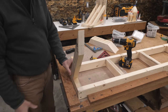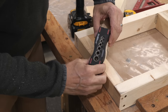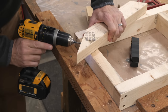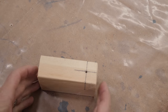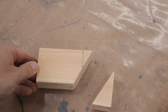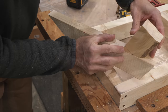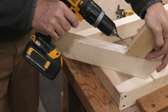The 30-degree end attaches to the underside of a shelf cross member; the other end screws to a stud. For the 60-degree end I used a drill block, marking a cross on the angled cut then drilling a perpendicular pilot hole — easy since there's a large flat spot. For the 30-degree end I needed an angled pilot hole, so I made an improvised drill guide by drilling through a short piece of two-by-three then cutting it at 30 degrees on the miter saw. Pencil marks on the block helped me line things up.